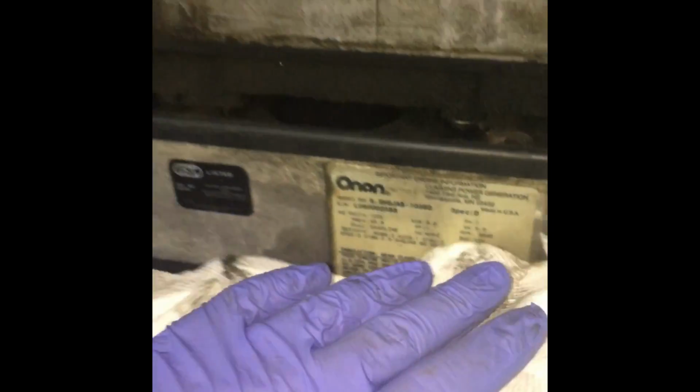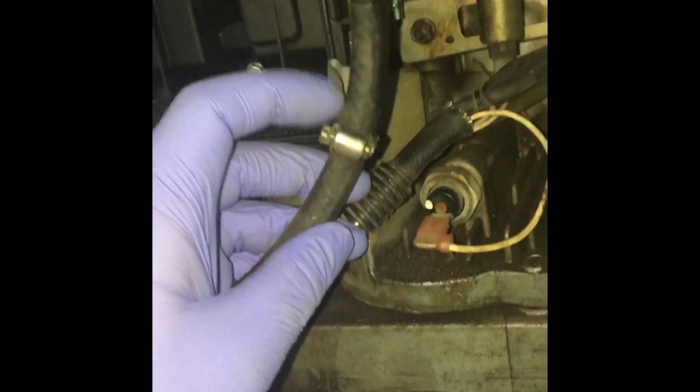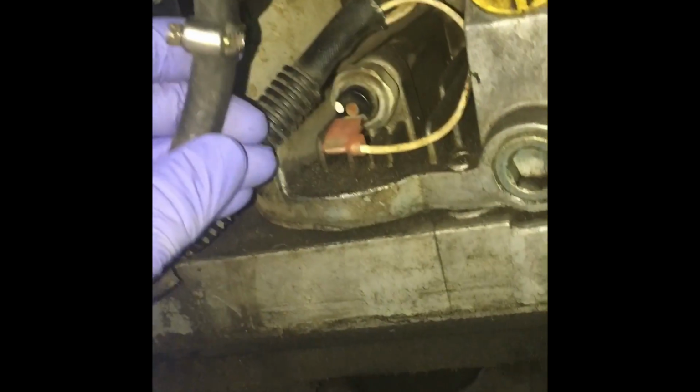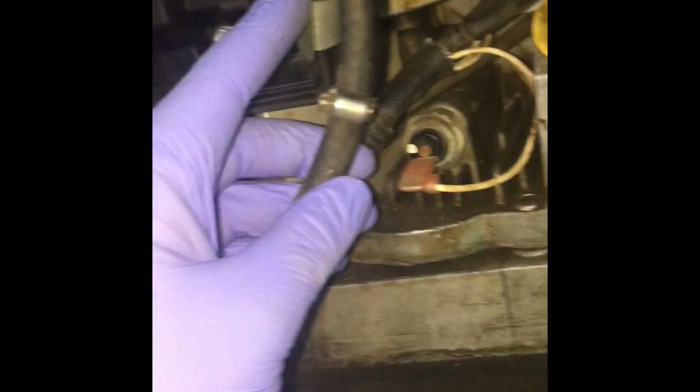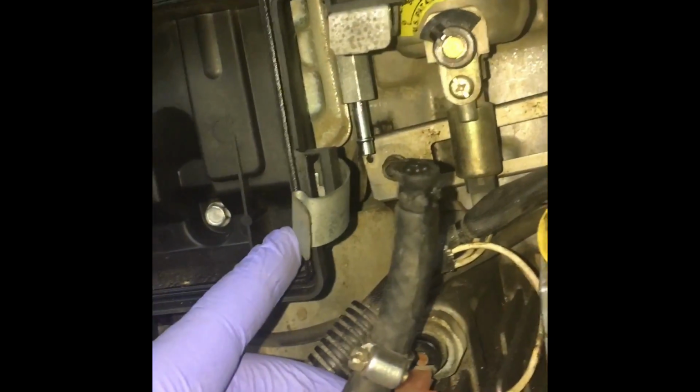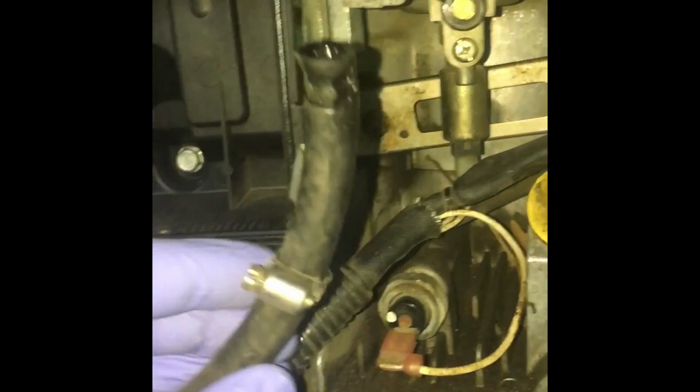And I'm wondering if there's anything in this hose. So I'm just going to move this paper towel, put it down here, tip the hose a bit. Oh, some did come out. So that's interesting. Not necessarily a bad sign, because the fuel could have been right there and not actually going up any further. Like I said, not even a single drip came out of the fuel filter. So I'm still thinking that it is probably dry in there. So I will continue and replace this fuel pump.